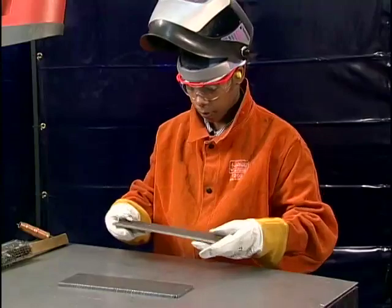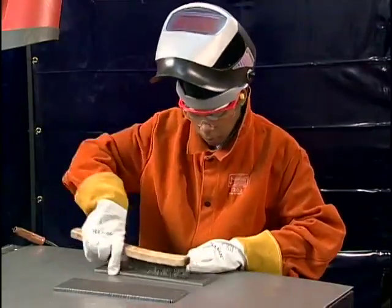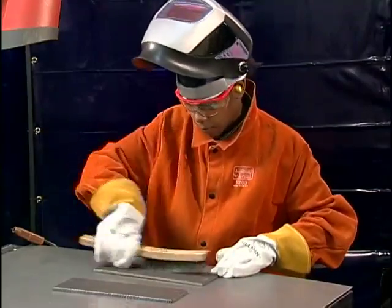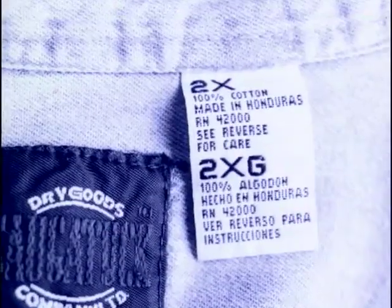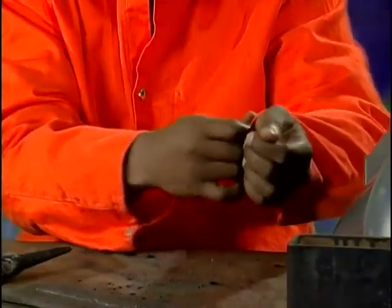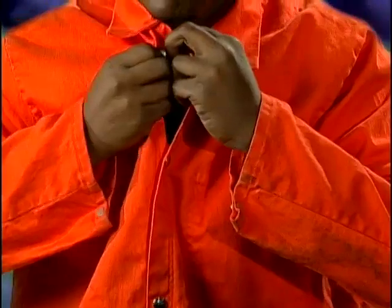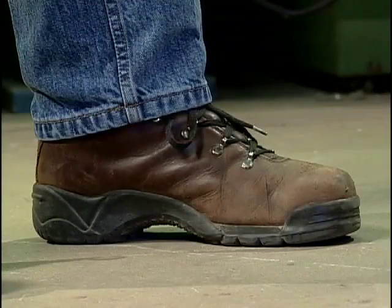Appropriate work clothing is required in any industrial environment, but in a welding shop, to protect yourself from burns, clothing must provide as much coverage as possible. It must be made of material that is tightly woven to block out light, and it must not burn easily. Synthetic materials should always be avoided. One hundred percent wool or cotton is a good choice — cotton is the most popular. A proper welding shirt must have long sleeves, a high buttoned collar, be long enough to be tucked in, and shirt pockets should be removed or have flaps. Pants should be straight-legged with no cuffs, and long enough to cover the top of your work boots. The best footwear is high-topped boots with steel toes, smooth to prevent sparks from getting caught in the creases.